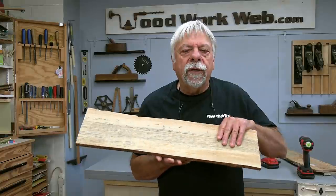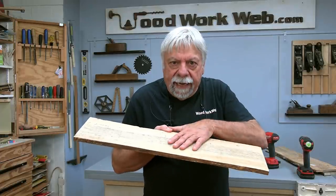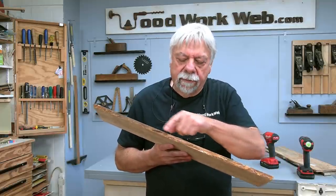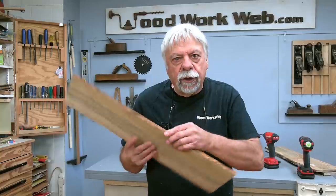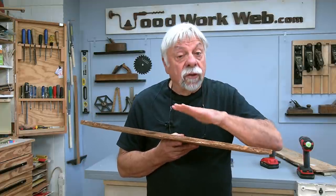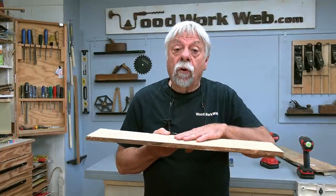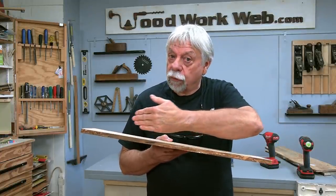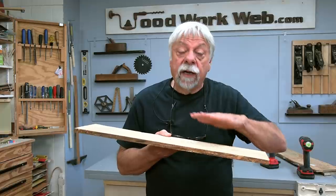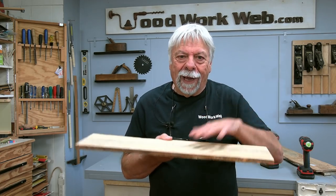Some of the reasons you might want to use these techniques: if you're new to woodworking, you're probably purchasing wood that's already planed from your wood supplier. But then you're cutting it on maybe a bandsaw or a table saw, and you'll be getting a little bit of a rough edge. Maybe you want to glue some boards together but you can't because they're a little bit on the rough side. If you're an experienced woodworker, maybe you're doing some curved edges, and this is a technique you'd be able to use for that. There are lots of different reasons you may want to use something other than a jointer, or if you don't have a jointer.